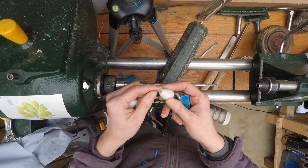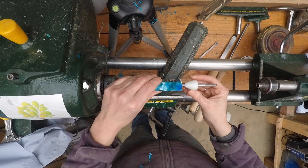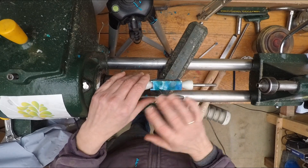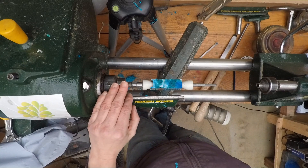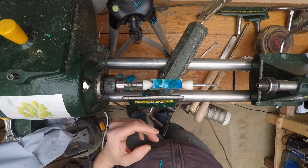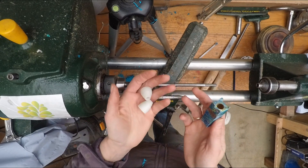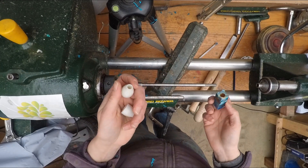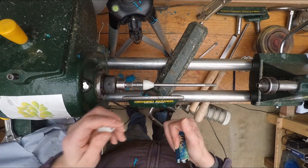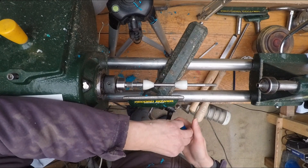I've got a couple of holes there, but I'm not really worried about that — it's only for the CA. I drilled the hole out the correct size for the mandrel, which is 7mm I think. I would shape the blank down and then these bungs would be used for doing the CA coating on it. Those are the new ones, and these are the older ones that are a bit worn out and raggy looking — I do tend to put them on, clean them up, and reuse them, they last for ages. We've all got a few milk bottles or HDPE plastic lying around and it's a good way of getting it for free. I didn't want to go and buy another tube — it's only a pound or two — but I was happy just to melt it down and use what I've got. Anyway, hope you enjoyed that — if you did, give me a thumbs up; if not, thumbs down. Leave any questions in the comments and thanks for watching.